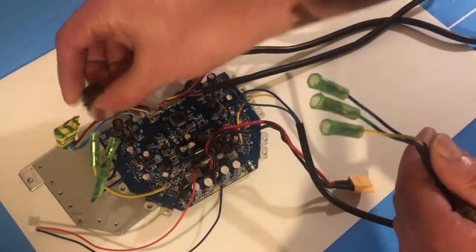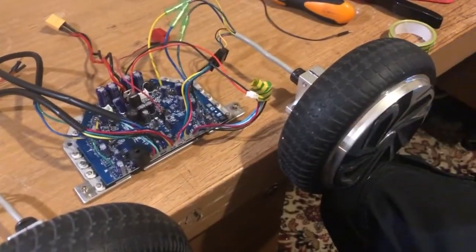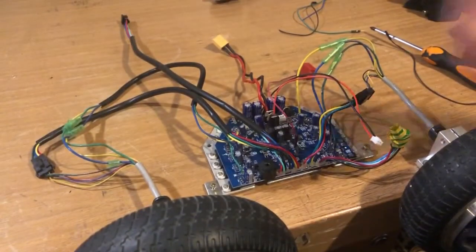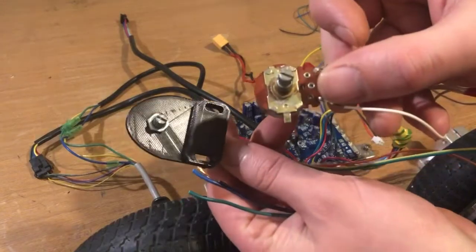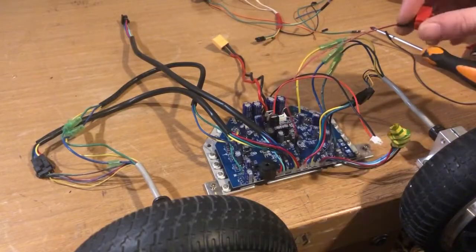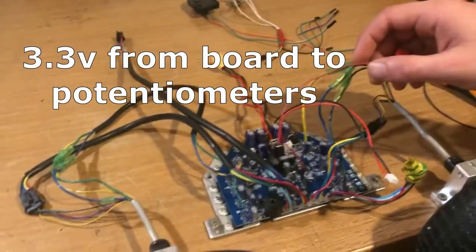All the other wires we need: motor wires, hall sensor wires, and we're going to keep the 36-volt wire for the Bluetooth, plus the battery wire. My setup has it screwed down to a table with a couple of wheels, all sensors and motor wires plugged in, and a couple of potentiometers. It's important with these potentiometers that you give them just 3.3 volts — conveniently, that fourth pin on the motherboard is 3.3 volts, so you can use that one.